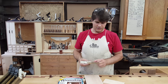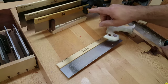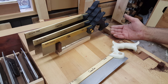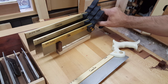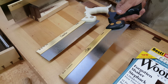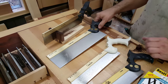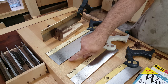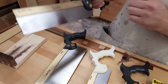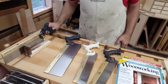We started selling our saws in 2008, and since then we've introduced a few more. This is our dovetail saw with the bone handle. We started making a crosscut saw, available in both handles — this one we call ebony resin, this one bone resin; it's a composite handle that works extremely well. Our crosscut saw has very fine 15 teeth per inch with just two thousandths of an inch set per side, giving you a super smooth cut. The next saw was our tenon saw, offering two and three-eighths to two and three-quarter inch depth of cut, with 20 teeth per inch up front to start and 12 teeth per inch in the back for a fast cut. We also recently introduced a medium tenon saw with a two-inch depth of cut, satisfying the demands of most mortise and tenon joinery in house furniture.